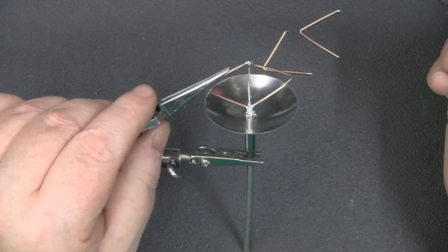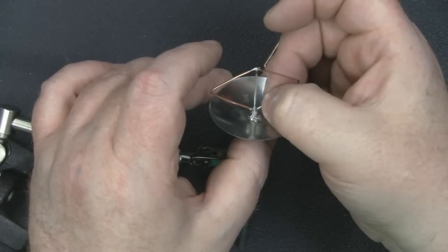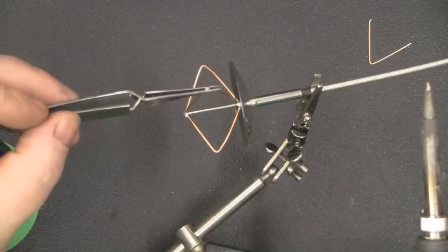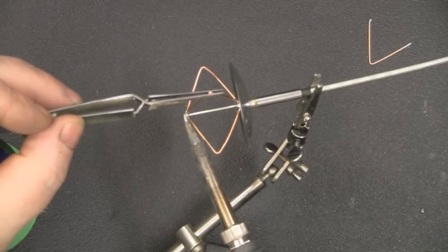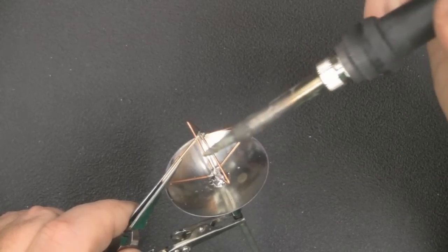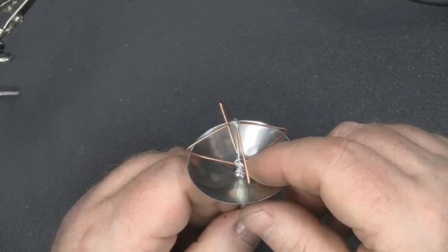That's now soldered in place — really strong with plenty of solder. When the main driven elements are built up as well, I'm going to add a little bit of epoxy putty around there to protect everything and make it even stronger. The key to soldering the elements onto the center wire correctly is to pre-tin all the solder points. I've got solder on the end and bottom, and all my elements are pre-tinned, so a little bit of heat flows the solder into place. For the bottom legs, bend them so they sit naturally at the point where you want to solder them, and use tweezers to hold elements — they get very hot.